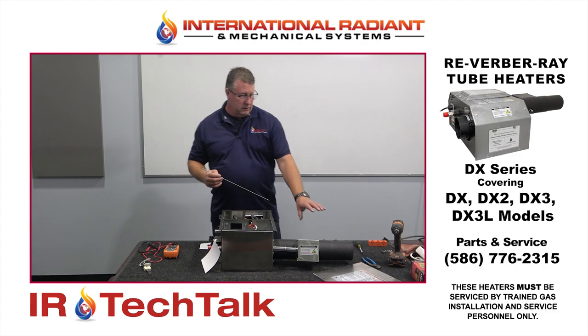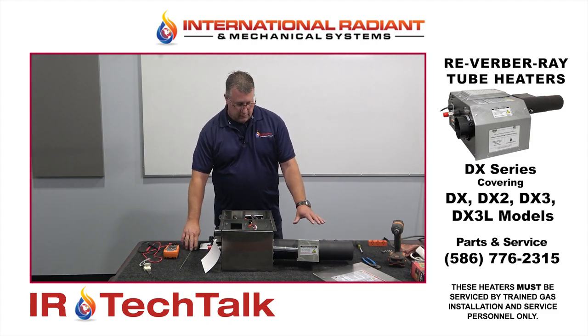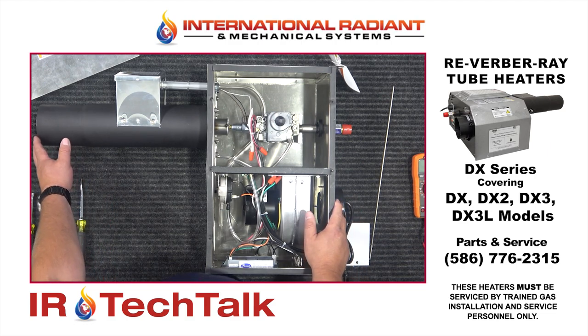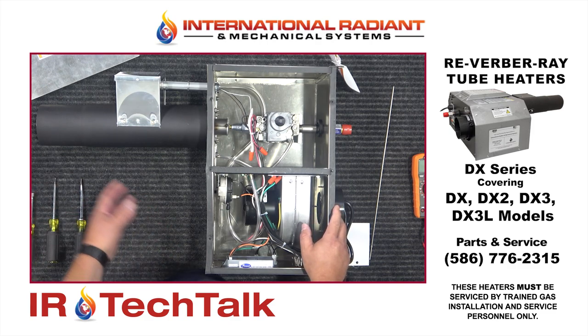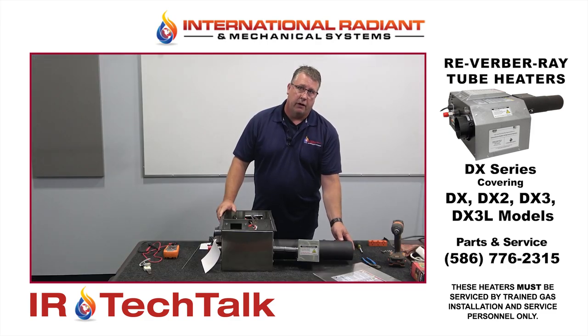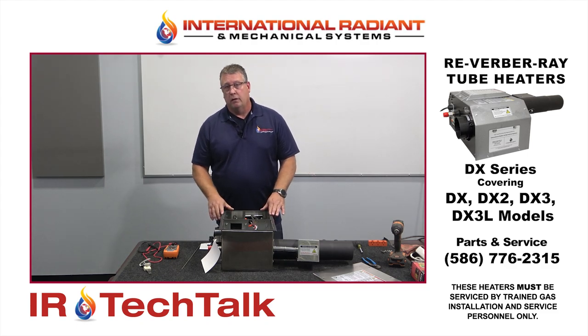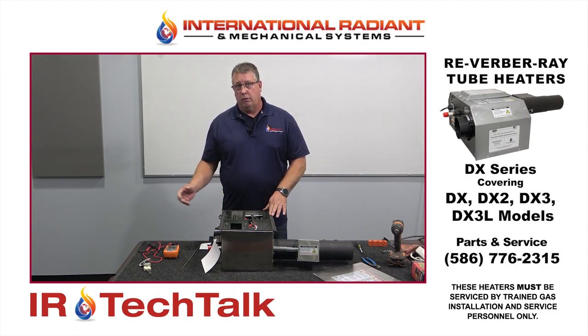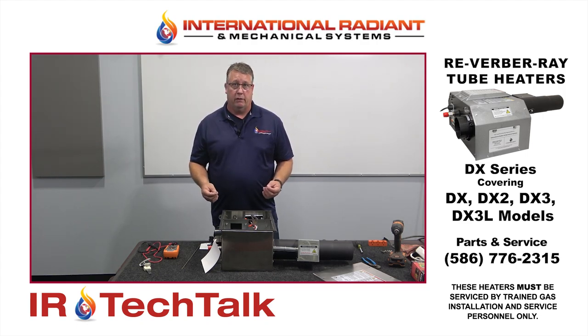The other side of things is the exchanger pipe. On my desk here today is just the power head, but in service these heaters are hooked up to 20, 30, 40, 50, or 60 feet of exchanger pipe. Very often that exchanger pipe could become restricted — there could be a bird's nest in the exhaust, or on an older heater there could be sooting in the pipe that would need to get cleaned out. You could throw parts at this all day long, but if you have those external variables you're never going to get to the bottom of your problem until you remedy those issues.